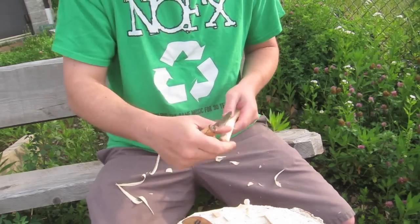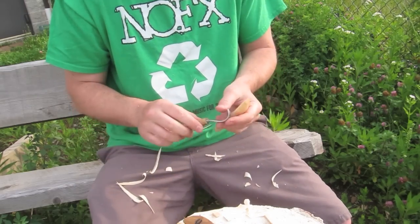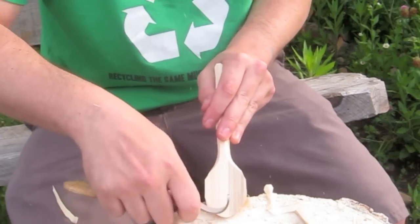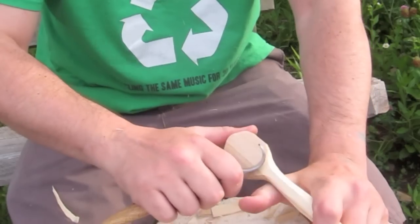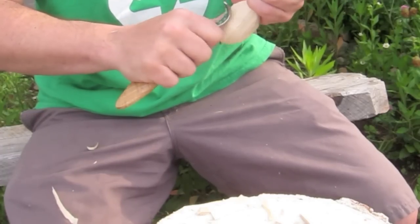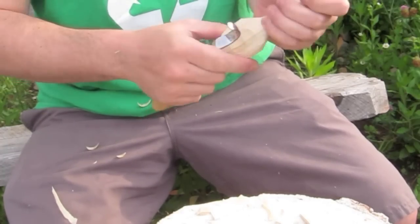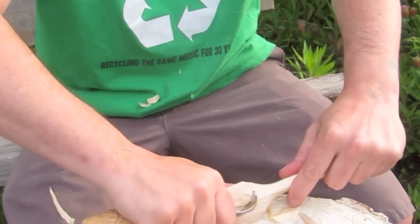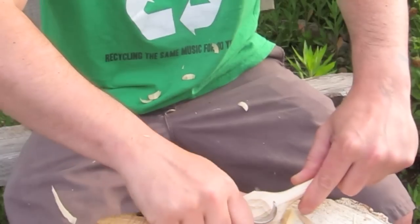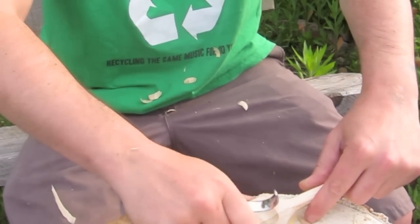When I'm doing these arm pushes, especially on this size of spoon, I'm generally not pushing with my whole arm - I'm doing more of a rotational push because it really helps in a lot of situations. I'm trying to work on the ground here and figure out a comfortable position, which is just not naturally what I do. With spoon carving knives it's not the same as a normal paring cut - that one towards the thumb, you're probably going to catch your thumb a bit. Wear some protection the first few times. Make sure your knife is really sharp.